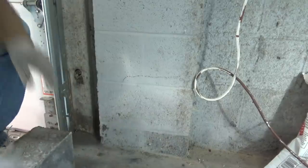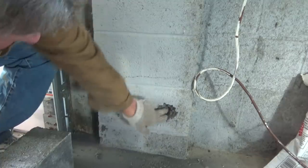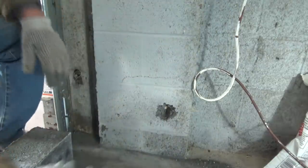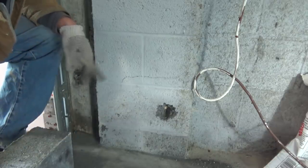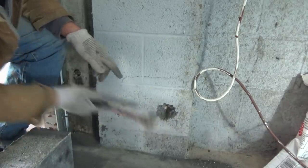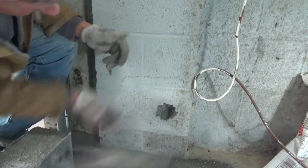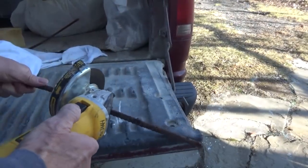One thing I wanted to find out is whether these blocks are hollow. We know these blocks are filled with cement, so what I'm going to do is get some steel, drill as I go, and pin the block. If they were hollow, I'd bust a block through and do something a little different. So what I'm going to do is cut myself some rebar to make pins.